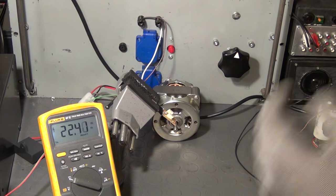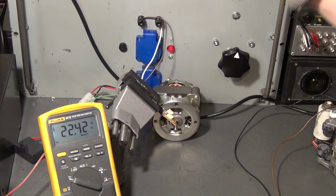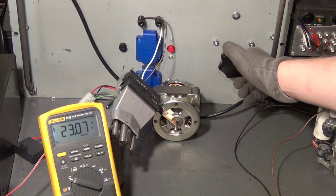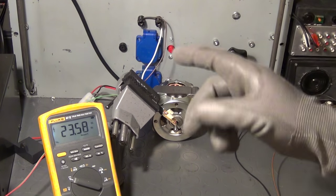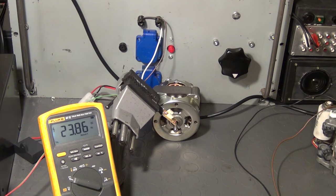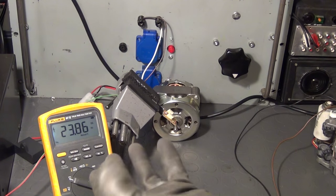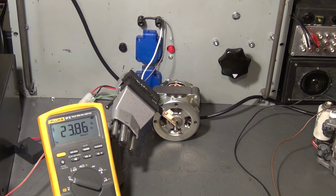That is because the motor is not really loaded, but it also shows us that the frequency of revolution of the motor is directly dependent on the line frequency, but not directly dependent on the supply voltage — at least if it is high enough to power the motor. If I cranked up the voltage even more over 230 volts, I guess we would not even see an increase in frequency. The motor would be a little louder maybe, but no real increase in frequency, at least not over a certain percentage. And that is why I made these three examples: to show that an induction motor is hard to start — you need three-phase AC or a motor capacitor — but it is easy to control in the sense that it will stabilize at a certain frequency of revolution without any circuitry.